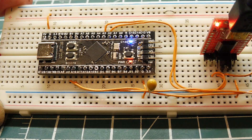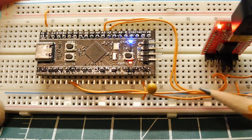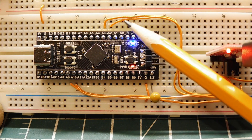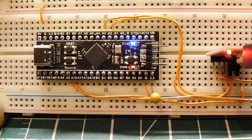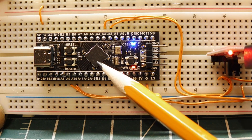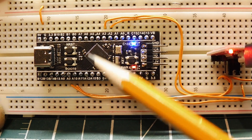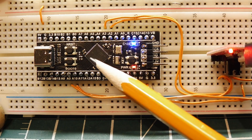Here is my setup for development. I have an FTDI module — a USB to serial converter — connected to USART2 on the microcontroller using GPIO pins PA2 and PA3. You can see the TX and RX lines feeding down to the FTDI module. I'm running a Forth operating system onboard the microcontroller with an onboard compiler, interpreter, and programmer. So all I need is a serial terminal program like PuTTY or TeraTerm to access the microcontroller for development.